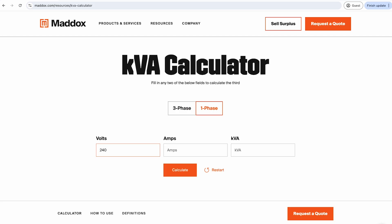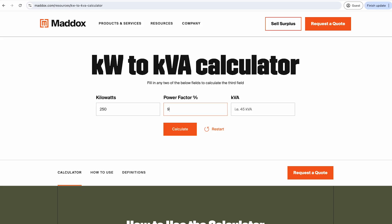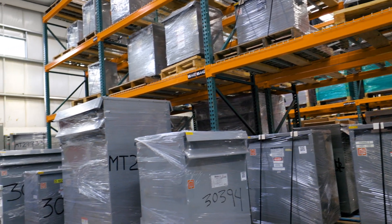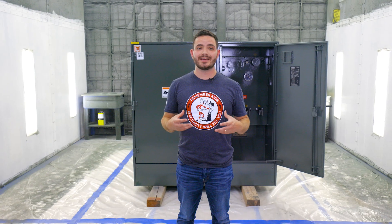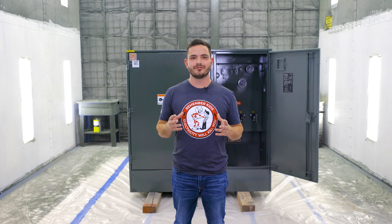If you don't want to bother with these formulas, visit our website and use our free kVA transformer calculator — we'll put the link in the description. For motor applications, we also have a calculator that converts kilowatts to kVA. It's important to size your transformer's kVA correctly. You don't want it to be too large because that means you've overpaid and the transformer will not be running at peak efficiency, and you definitely don't want it to be too small since this can lead to overloading and damaging the transformer. You want to size your transformer so that it's typically running somewhere between 50 and 80 percent of total capacity.